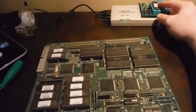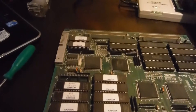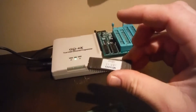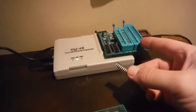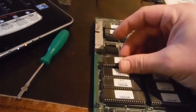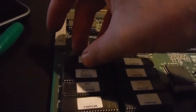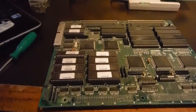I had no issues erasing the three EPROMs — three, four, and five. I put a little scotch tape back on the label to cover it back up. Here's the 16-bit adapter for the GQ4X — it doesn't come with the programmer; sometimes you can buy a package deal. I use it all the time for the larger EPROMs. I'll socket them back in, and before I put the case back on I'm just going to try it without the case. Once that's in, I'll put it on the A-board, plug it in, and see what we've got.